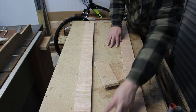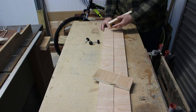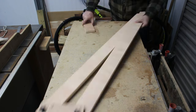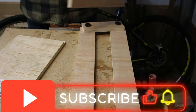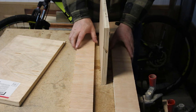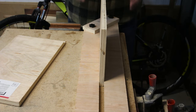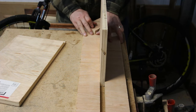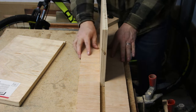Final assembly on this is dead simple — one at each end, through there, then screw in. I have a piece of three-quarter inch ply and I'm going to set the width of the jig now. It works by clamping in opposite directions, so you put pressure on it to make it nice and tight. If you don't get that pressure forwards and backwards, your cut is going to be a little bit too loose.